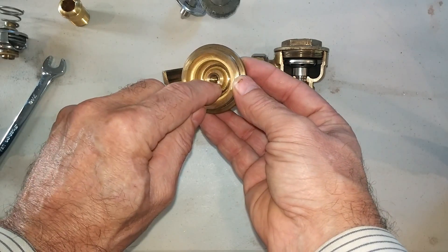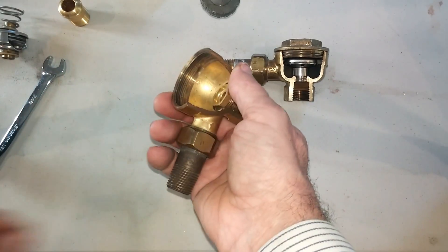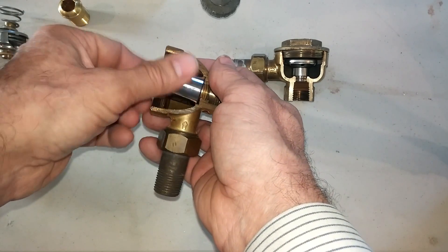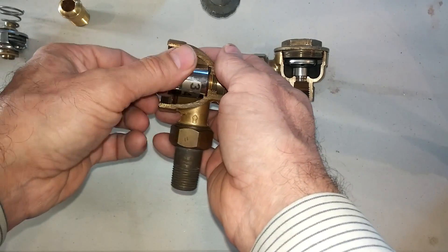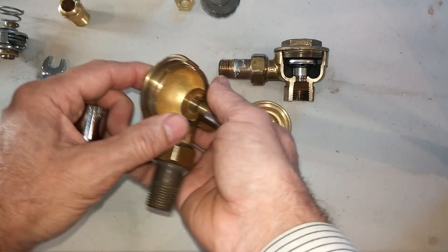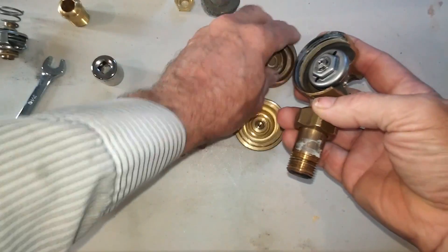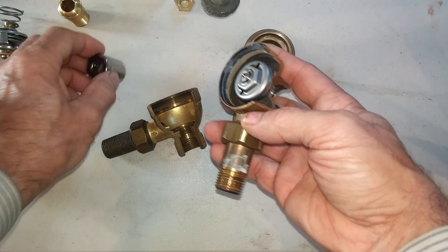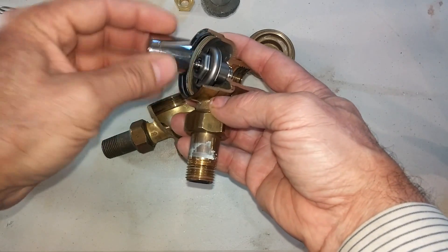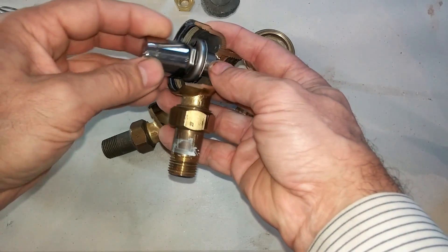The trap has a threaded hole to receive the unit, but the broken piece is discarded. You take a three-quarter-inch socket and remove the old seat. Now you can go ahead and install a Durastat — it has a clever stamped fitting so you can use the same three-quarter-inch socket to install it, should you so desire.